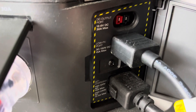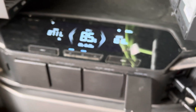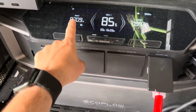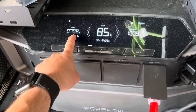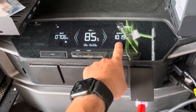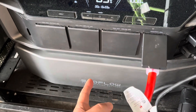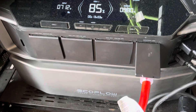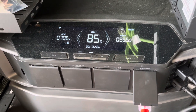The low-voltage solar input on this can go down to 30 volts DC, and it's an MPPT input, so it can get as much power out of that as it can. You can see I'm getting about 700 watts from the car, and the house is only using about a thousand watts right now. I've just extended the 6 kilowatt-hour battery — as long as I can pull a charge from the car, it'll be a long time at only a thousand watts or less.